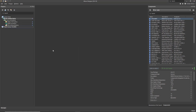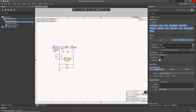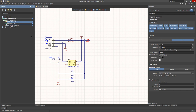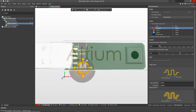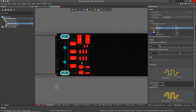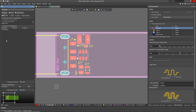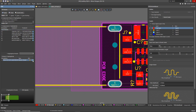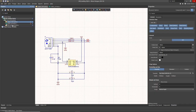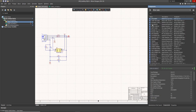When I create that, it creates a copy of the template files. In this case the template includes not only a schematic template — which includes the necessary USB connector and protection devices — it also has a template for the PCB. You can have individual document templates or whole project templates like this one. This one even includes a mechanical enclosure for a USB thumbstick and all the basic components needed for the USB Type-A connector. We also have a bill of materials document, and components will automatically find their way into that as we add them.